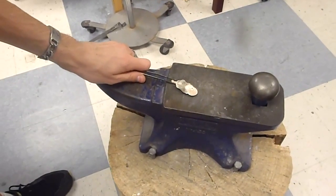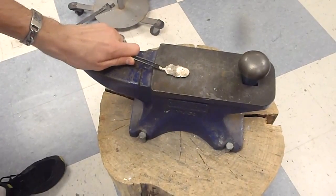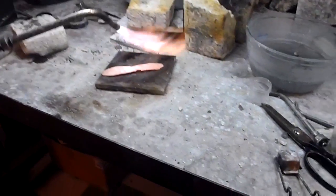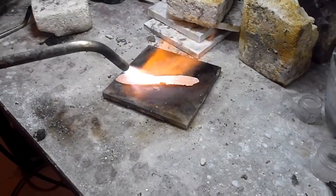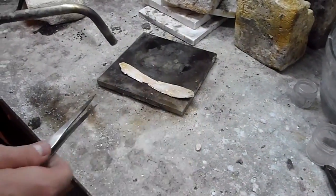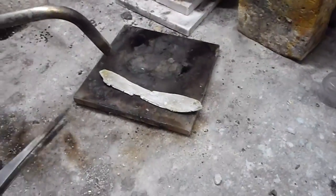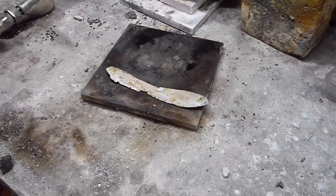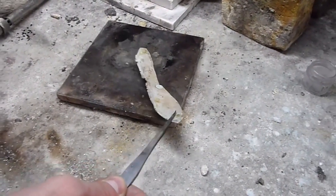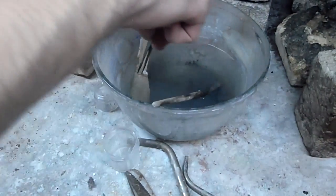So now I've taken the hottest, largest piece and I've brought it over to an anvil where I am stamping it a little bit flatter before I get it so work-hardened that I have to use a rolling mill and anneal it to get it any flatter. You can see that after the pour, we've come in and flattened the metal through a roller — we skipped that segment, but we'll show you the next few rolls. Right now it's about 12 gauge in thickness, and it needs to be less than that for our purpose. We are going to anneal it every few gauges, which just means heat it up, then take it over to water and quench it, and then take it back to the roller.